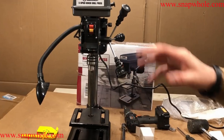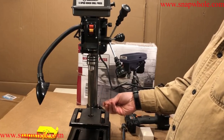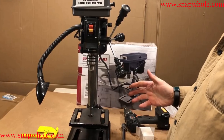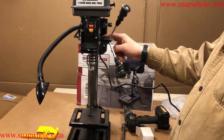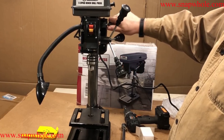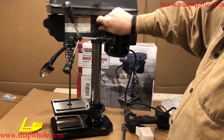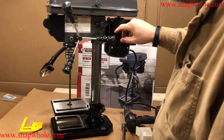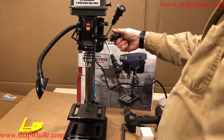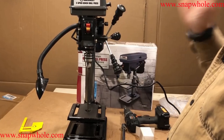If I had planned to use a drill press for anything other than countersinks I would not have bought this one. I want two drill presses with countersinks and one to drill stuff with. So this will be on the shelf with a countersink only — no pre-drill bit. It's amazingly fast to put together and not very complicated. It only has set screws on one side, but on a lightweight drill press like this I'm not sure that's a problem. The motor only sits on one side, and it's only got a two-inch travel — but for what I want it for, it's almost perfect.